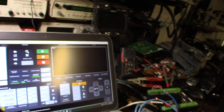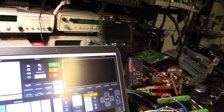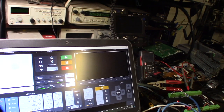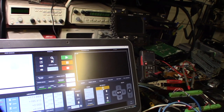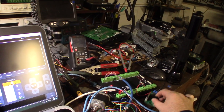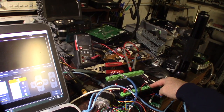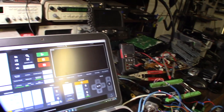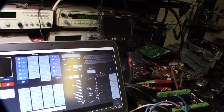None of this stuff actually works - I can't move any axes and none of the outputs work. Even when I trigger the spindle output, the MOSFET should be triggered with 24V common, ground-triggered, but I'm not getting any output. I've tried my multimeter.